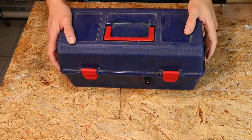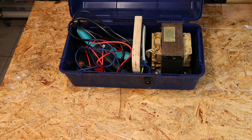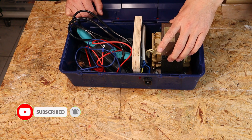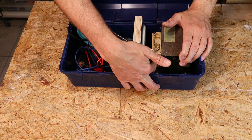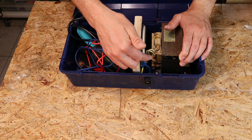I'll show you what I have done here and how easy it is, and you can decide if this is something for you or not. This is the machine I produce 2000 volts with — it's a very easy machine, basically one part. It's a microwave oven transformer. Every microwave you scavenge has this kind of part, and I connected the primary end — the wire with a thicker wire and fewer windings — to grid.